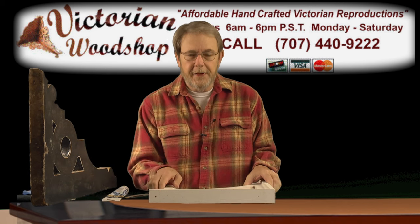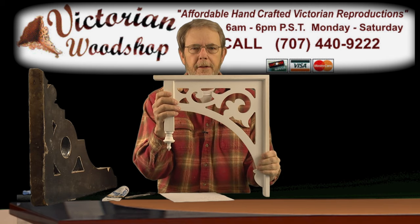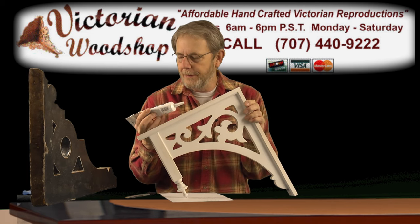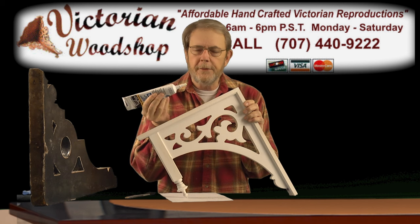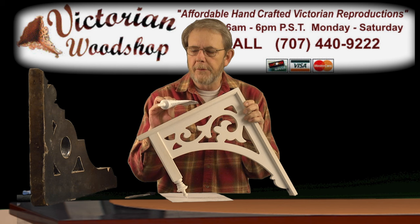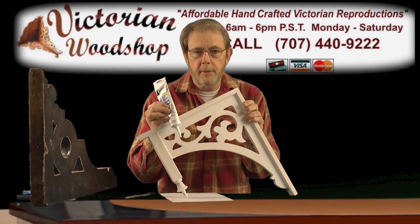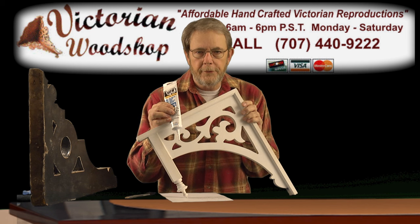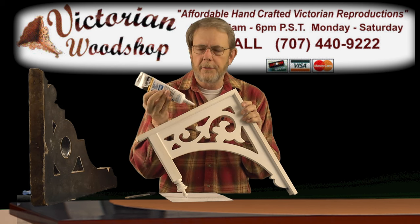Item number two. You've got your item in the spot, you've done your wood filling, it's a nice look and you're happy with it. This is going to separate you from a vast majority of people out there. This is another DAP product — but there are a number of different products you can use. A white exterior caulking, either clear or white. They make countless varieties of this exterior caulking. In your particular local area, check with your local hardware store. I suggest staying away from the big box stores — the guys and gals down there are going to know a lot more about what works in your particular locale for your weather. Extremely inexpensive — a couple dollars for a tube and it'll last forever.